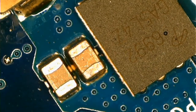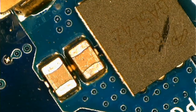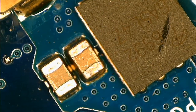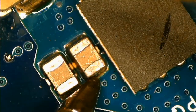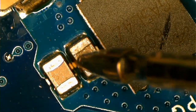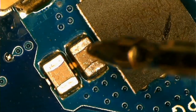I'm not sure if this is a hole or... no, no, this is just liquid. Anyway, we have a broken capacitor. Let's test and check for a short. I'm going to put my mic close to the multimeter so that you will hear. This one is a short. Even this one. The capacitor — let's call it the short. It's this guy. This is the bad guy.